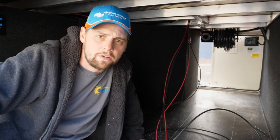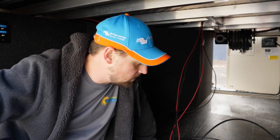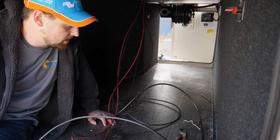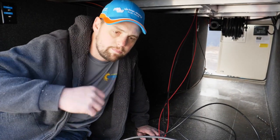Now that we've got these wires through, we're going to go ahead and put the panels on the roof, get them secured, and put the junction box up to tie in the module PV wires coming in on this MTW. We also ran a coax cable for a satellite dish, as well as a coax cable up top for a Wi-Fi or cellular antenna.